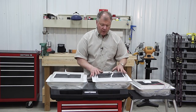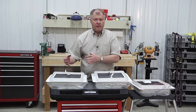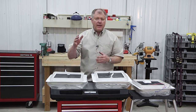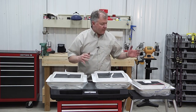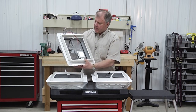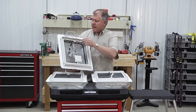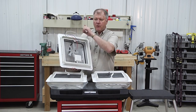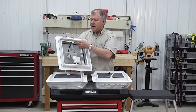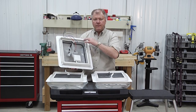Some manufacturers will pre-wire that area; others won't, but they'll put little raceways in to a light. So look and see if you've got any power around that area. The challenge with the automatic vent is that even if you have power up in the ceiling, you've got to bring that switch somewhere — you'll need to route a pathway along the sidewall and bring it down to an accessible location. It's not real easy to install if you don't have something pre-wired.